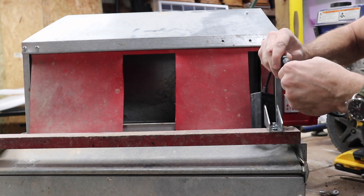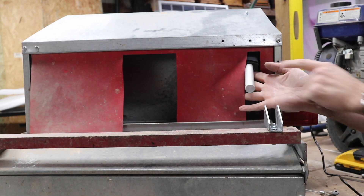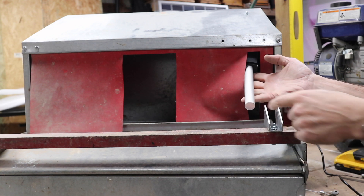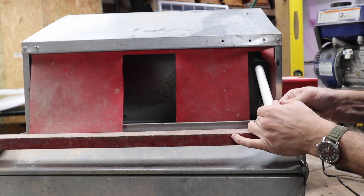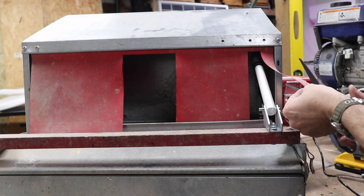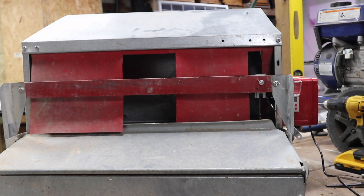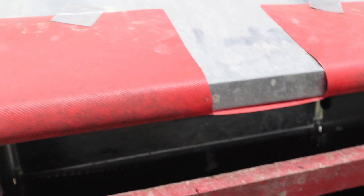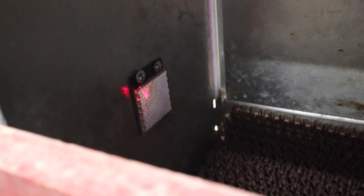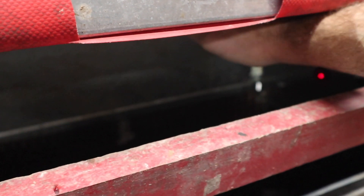Here's the AC power adapter — click it on, plug it in, and get the actuator out so we can adjust it. As soon as you plug it in, the actuator will operate, so make sure it's not stuck inside. You can see it came all the way out, and I'll put the push pin right back through it. My slot wasn't exactly perfect — I went a little too far, but just give it a trim. Now that the bar is closed, I've taped up the curtain so you can see the laser. I'll put my hand in to show you what happens if a hen gets stuck inside. I'm going to break the beam — boom. It automatically opens.